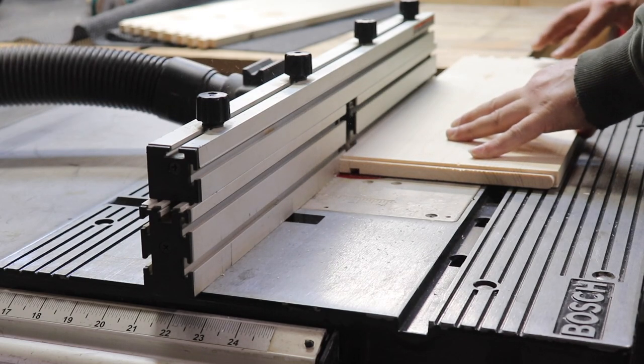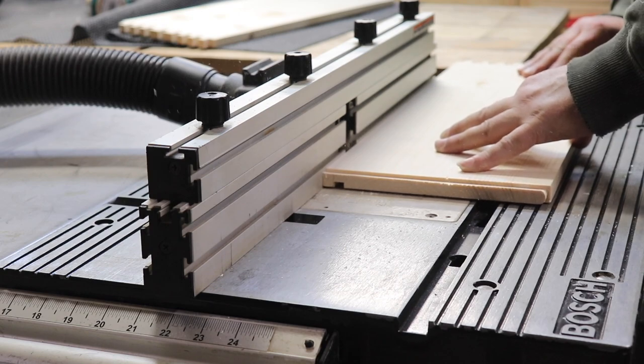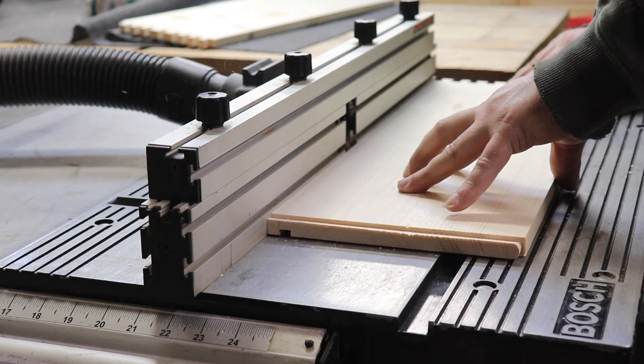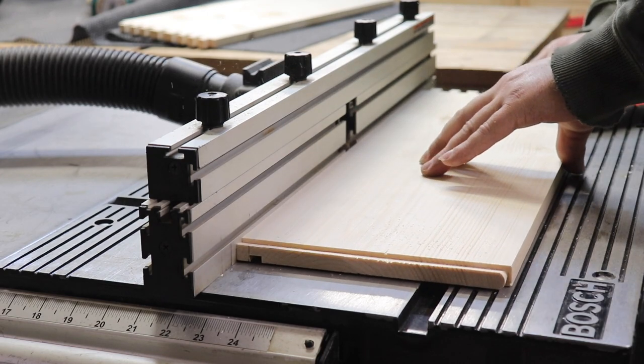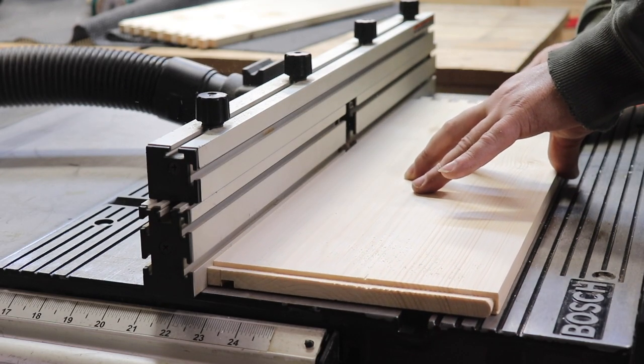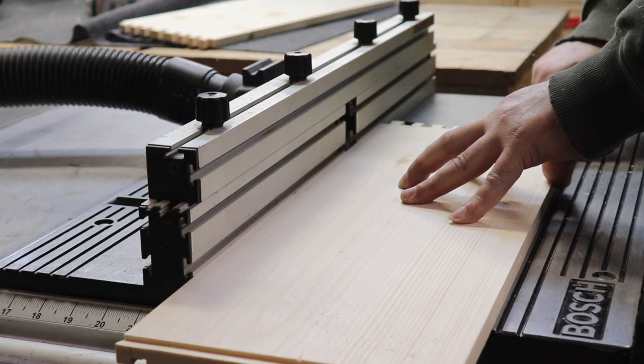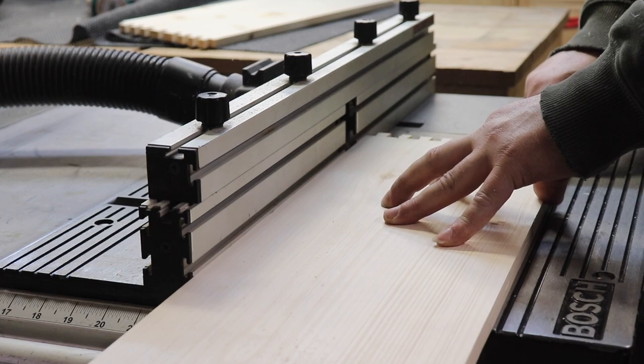Now for a half inch dado on the two sides in front using a half inch straight bit set at a quarter inch depth. Then I'll rip a half inch off the back so the half inch plywood bottom will just slide into the dado. Then use a couple 1 1/4 inch finish nails to secure the drawer bottom in place.